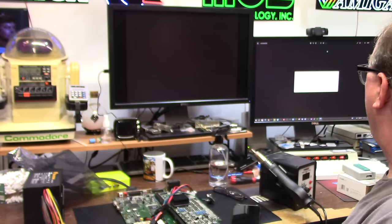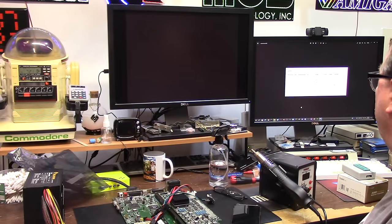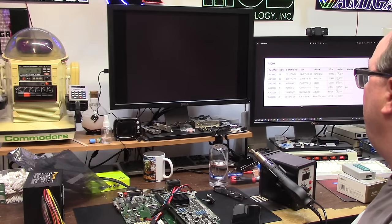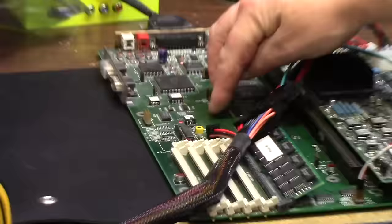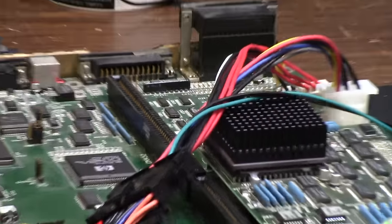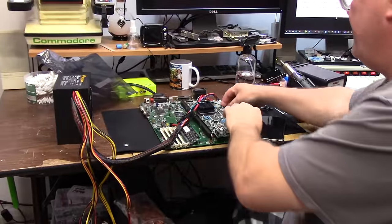So, we're going to look into the GAL codes. GAL codes, what is this madness you speak of? Well, there's about 6 or 7 chips that make this thing be able to boot, and it has specialized code in these little chips with the white stickers all over your board for different sections. IDEs back here behind the 3640. I'm going to turn this off, and I'll show you.